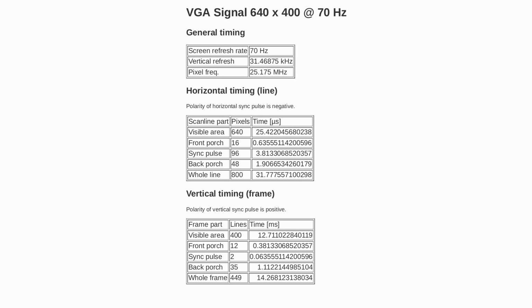My PC monitor handles that mode pretty well, displaying it even with the correct aspect ratio as far as I can tell. My TV, however, and my three HDMI capture cards don't really like it very much. It might have been standard in the DOS days, but nowadays not so much. Although, it's still supposed to be the same timings as the default DOS text mode, so...